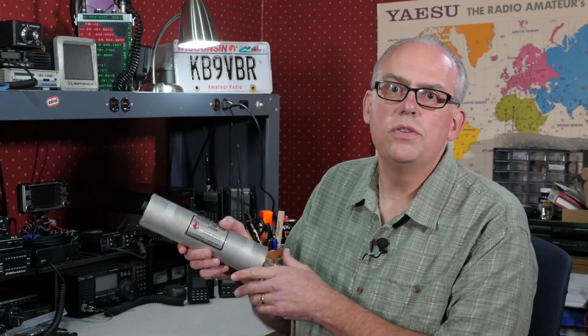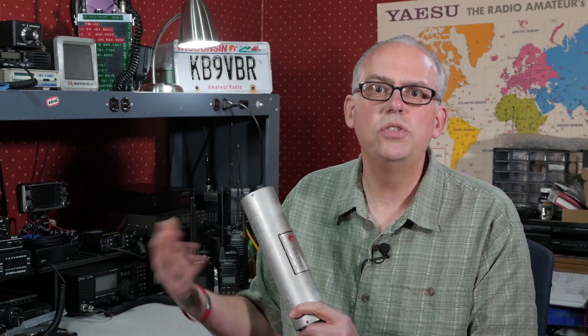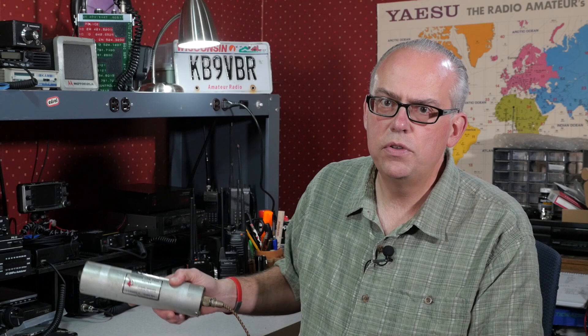Thank you very much, Joe, for supplying that video and filling in for the channel during my recent and very brief demise — it's really appreciated. If you want to see future videos from Joe, leave me a comment below. We'll make sure to get him fixed up with a better microphone, though. These low-pass filters are a really great station accessory to have. You can find these used at a hamfest for less than $20 — I wouldn't pay more than $20 for one on the used market. They're really cheap used, and a great accessory to have especially if you're going to run with an amplifier, because they'll cut those harmonics and spurious emissions above 30 MHz.